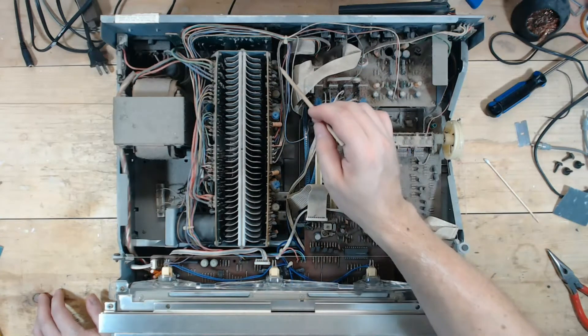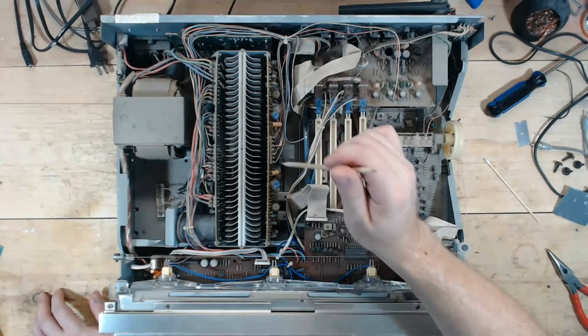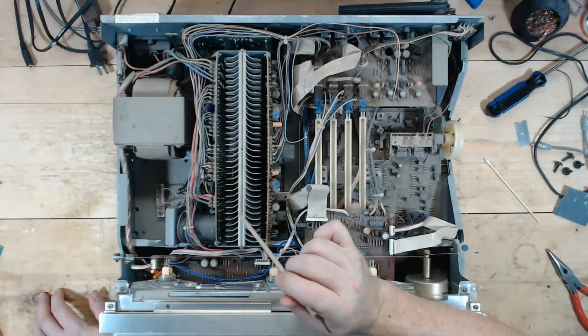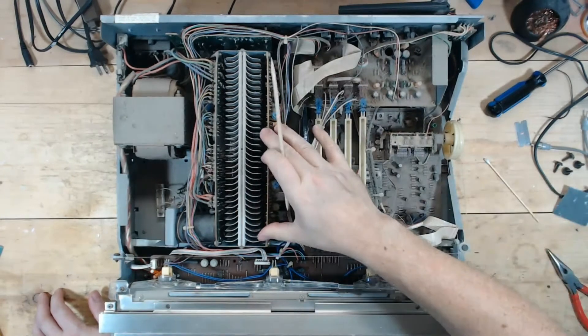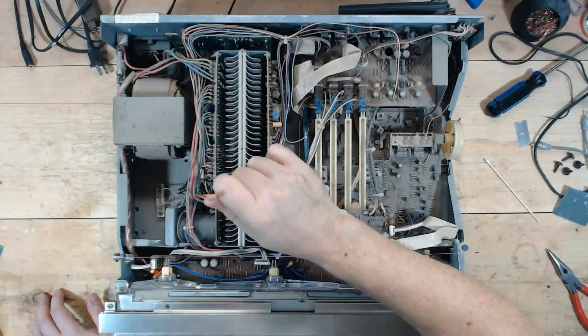This has the originals installed. I was wondering if that was what was repaired in the 90s, as the original owner said. So before I power this on, I will remove these screws, kind of flex the board this way a little bit, and just see if I notice any cracks. The best way to do that is to remove the board, but I just want to do an initial inspection.